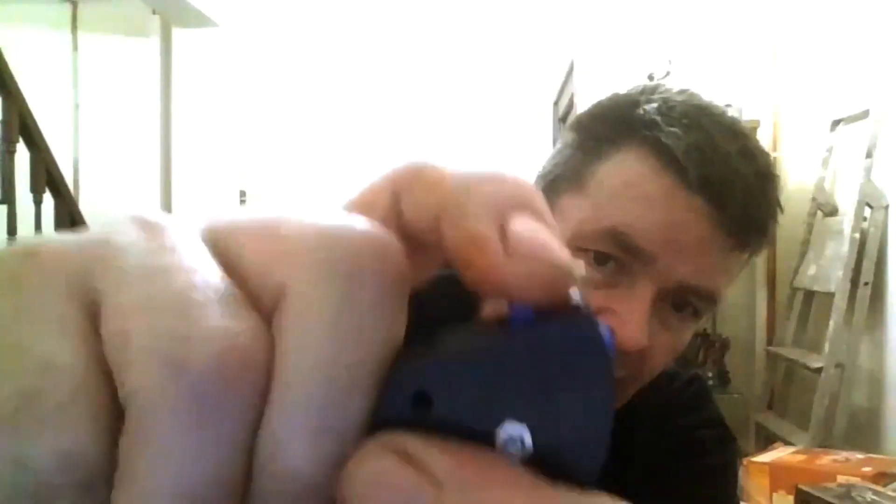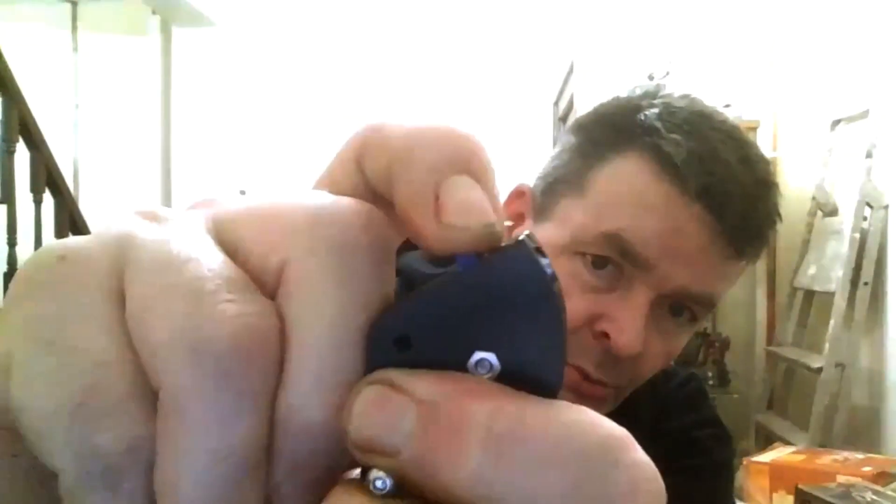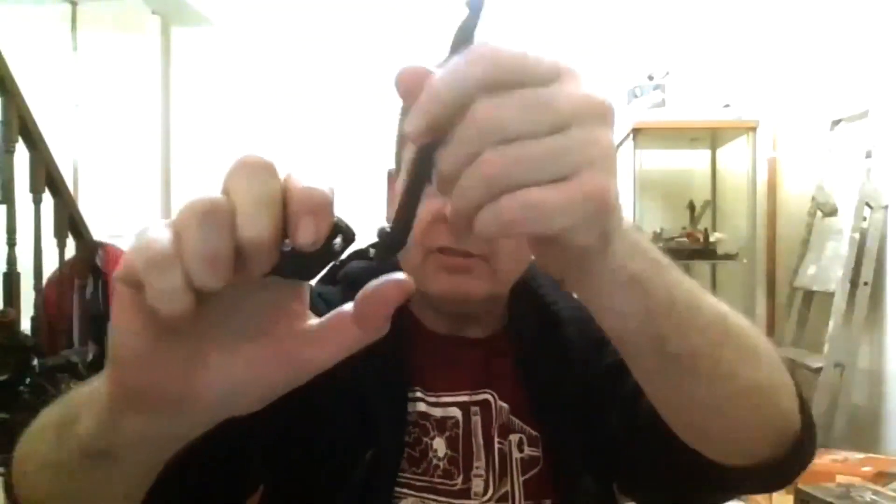This screw is now in. Your safety catch releases there and as you press it to release the trigger, you can see it's working fine. It's only a little bit of movement because it doesn't need much pressure to lock in place — it's actually a very good design. The next stage is to push your retaining spring inside, which can be a bit tricky. You'll see why I already fitted this screw beforehand, because when you push the lever in it'll naturally want to push back out. I'll need both hands for this so this will be another cut.